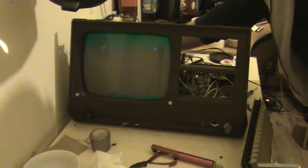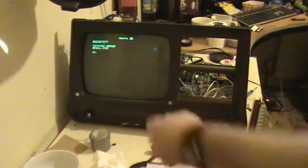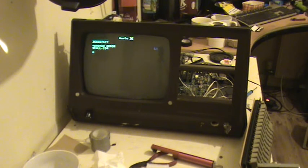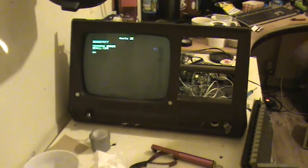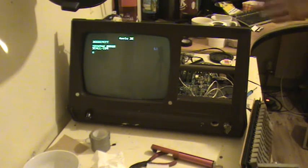And still nothing. So I said maybe the Videx card is dead. But then what I read further is that the Apple IIe already has this higher graphics memory. I mean, it already has the 80 column display built into it. So I reckon then that the Videx card is basically null and void. There's no need for it in this machine. So that's where we're at the moment. I have to get the original Apple II board working to even see will this Videx card work.